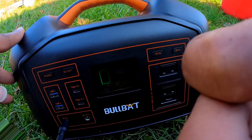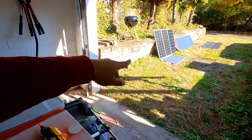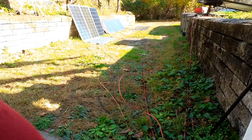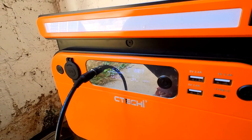Look at that — it's getting 53 watts. That's two 70 watt panels. I don't know how crazy I am about that, but it's power. Here's my dilemma: I don't know if these have a film on them, so I'm going to message them to see if I need to peel it off. Them getting 53 watts — that's 25 watts a pop — looking at a 140 watt array, that's not great. It's also not angled very well. Let's see what my 100 watt panel is getting — still adjusting, 30, 32 watts. That feels really high, but I'll take it. So a 100 watt panel is getting 30 watts, and those 70 watt panels are getting 25. Maybe that makes sense at a flat deploy. I can't angle them because they're weird. I'm going to message him and then we'll finish up this video.